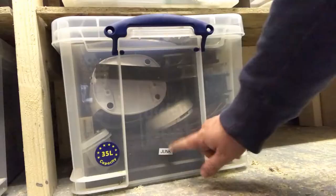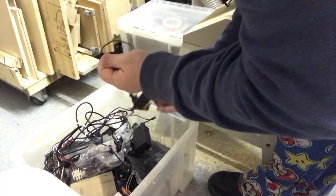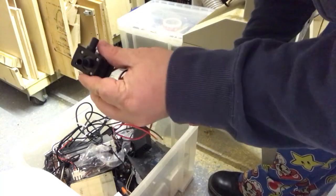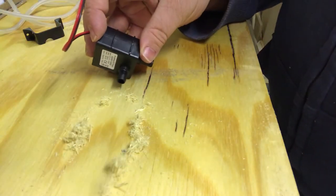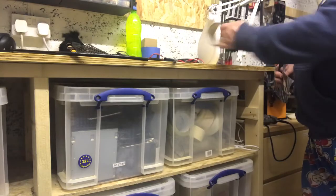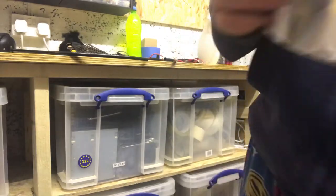The blower was next on my list, as its tiny little bellows offered very little actual dust displacement, and I often found I couldn't see exactly where I was cutting. I found an old aquarium air pump in my scrap pile and gave it a quick test to see if it could displace dust a bit better. Success! Let's stick some air tube on there and come up with an elaborate mounting solution.